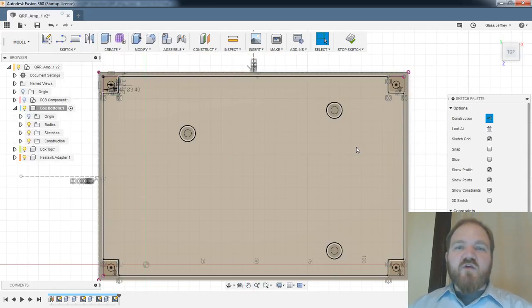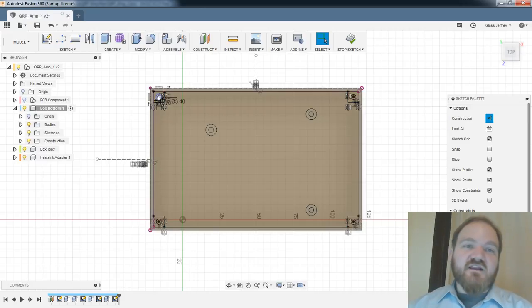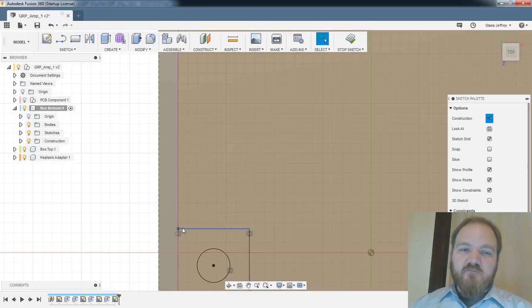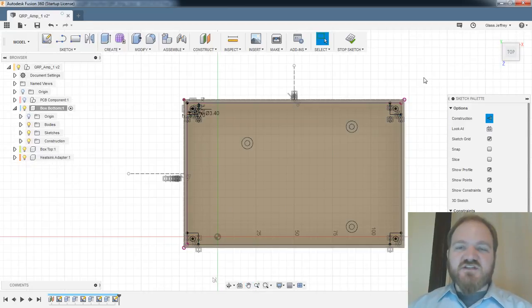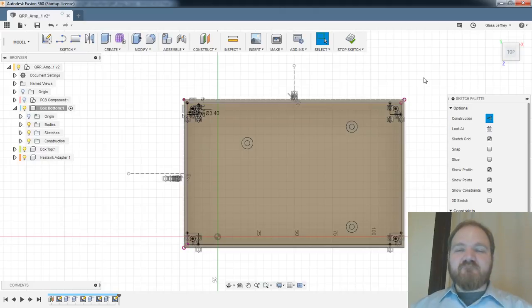Like, you'll end up at a point where, for example, it's not happening here, but this is a perfect rectangle that Fusion has created for us. I take this, which intersects the top of the rectangle there and there, I mirror it across one way, mirror it twice, mirror it again, and suddenly this corner, maybe these points are non-coincident by 0.00001 millimeters, right? I don't know enough about Fusion to say that that's actually a true floating point error, but